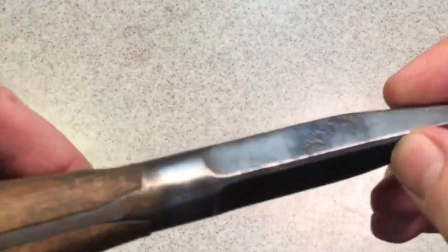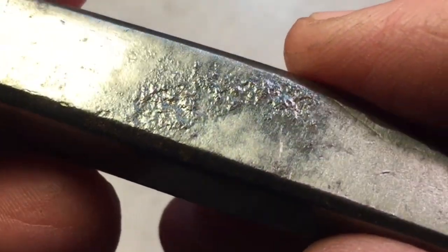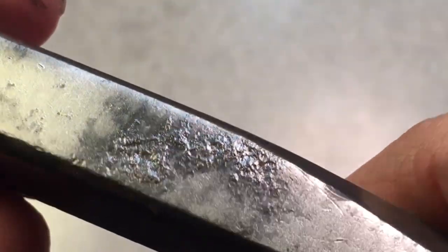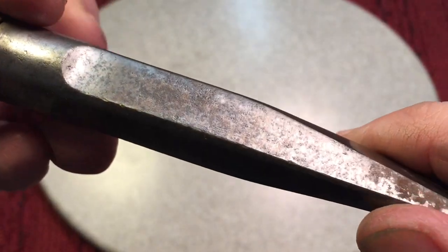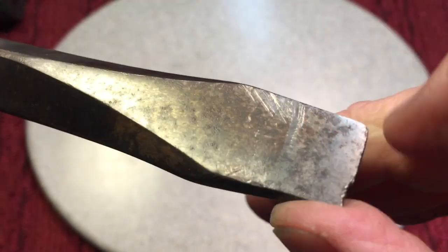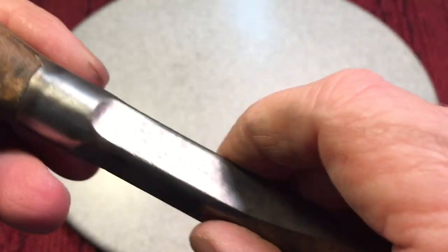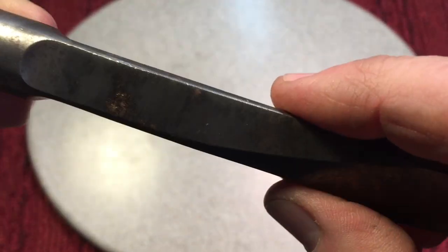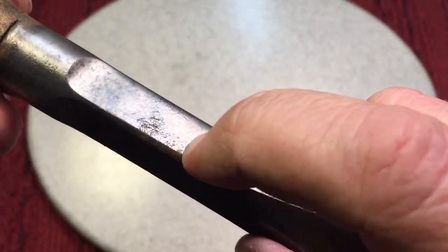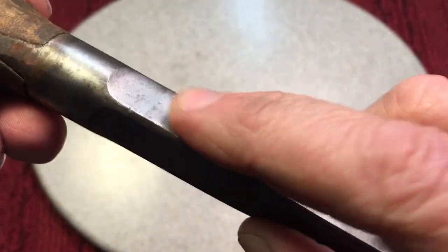Here's our post wire brush evaluation. No markings that I could see, but look — we've got that dreaded pitting right there. That's the worst kind of rust I hate. We've got some more of it over here. This part is just staining — that's not bad — but this pitting is the worst. This is when the carbon gets close to the surface and you get that bubbly rust. We've got to get that out of there.